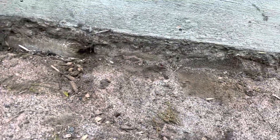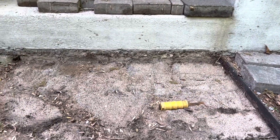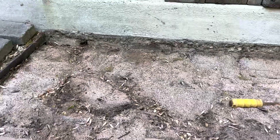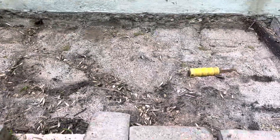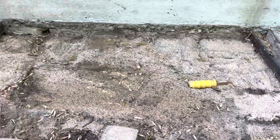There's probably an issue with some water also, but that's kind of interesting. Anyways, this sand has got to come out — you can't pack class 5 over sand because it's not going to hard pack. You want to go class 5 on top of class 5. I'll scrape this out; I probably won't reuse it, or I might — we'll see.